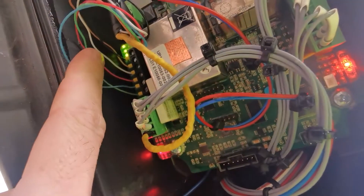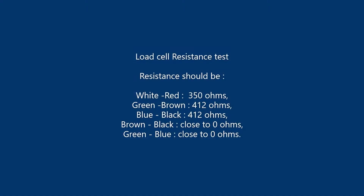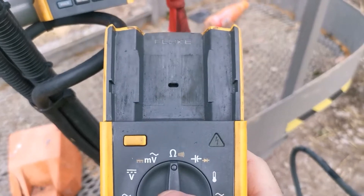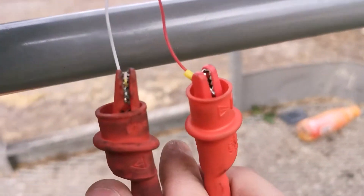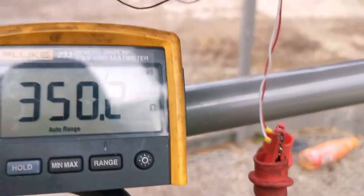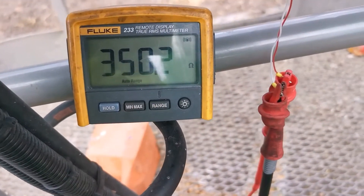So those three LEDs are showing the power supply, which is good - that's what it should be. So first thing I'm gonna do, I will measure resistance on the output side of the load cell. So, multimeter resistance mode and the range we're measuring is ohms. The meter is on the red and the white wires. Red and white wires is output from the load cell, and the resistance should be about 350 ohms. And that is good - we have 350 ohms.